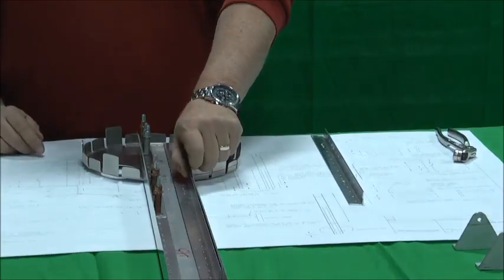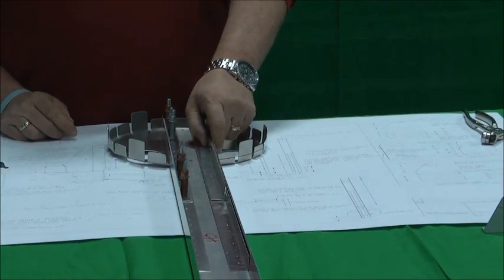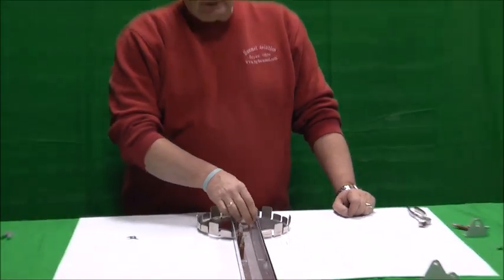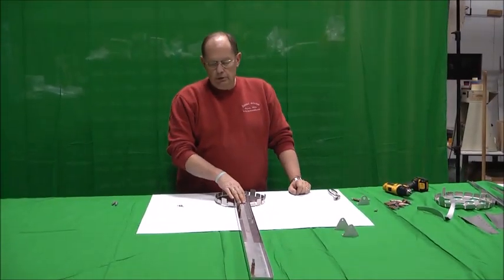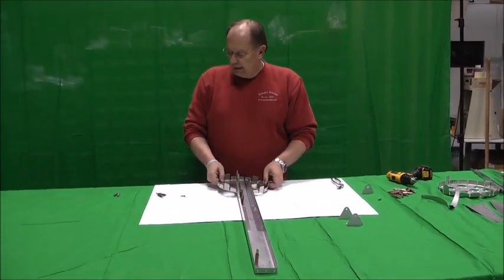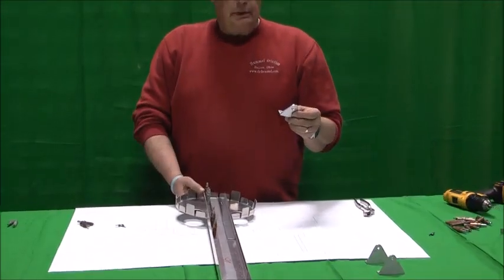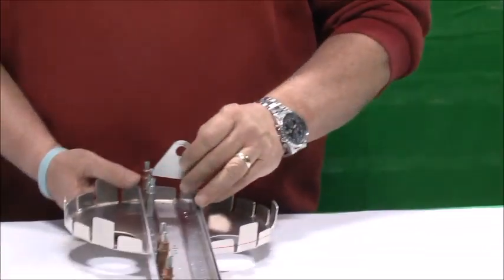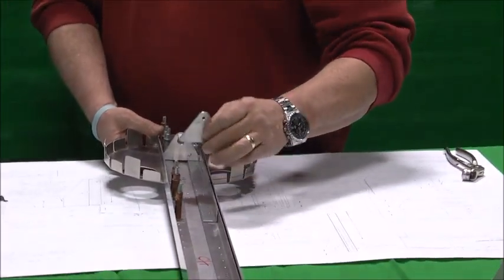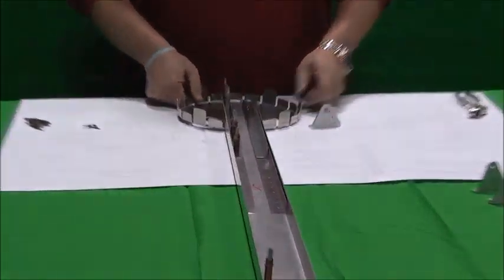The first 025 doubler lays on the inside of the spar. The other one is a 060 1/16th extrusion — that's made from a 1/16th by 3/4 extruded aluminum angle — so it lays inside of that. Then the lower rudder guide will go down here at the bottom hinge point; that's the rudder control hinge. And then there are two rudder hinges that will go on in the assembly as well. I've got one side kind of Clicoed together to hold it in place.